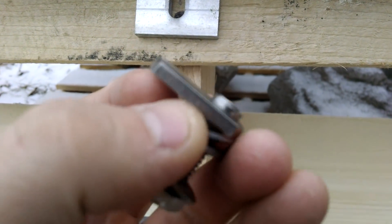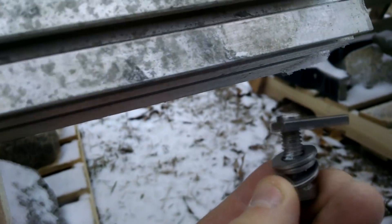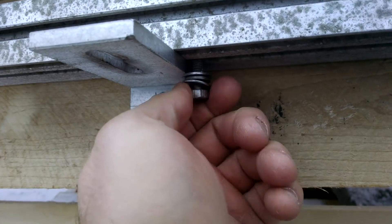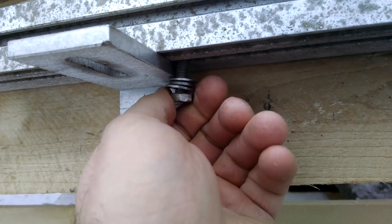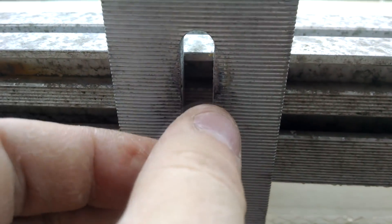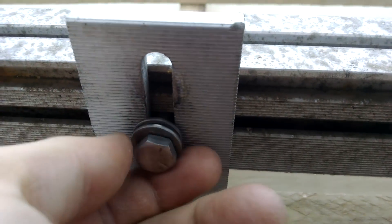This is the special stainless steel washer that I picked up to go into that T-slot. So what I do is I just feed this in at the end — just like that. It goes in the end, then I can run it down the channel. Slide the channel over — you can see the washer in there. And now I can fish this back in. I keep them all loose until I have all four in place.